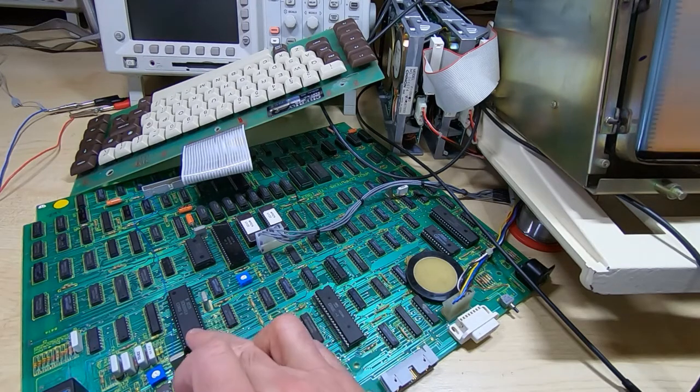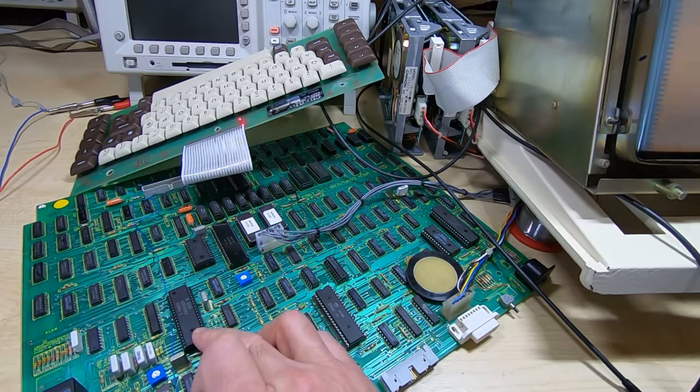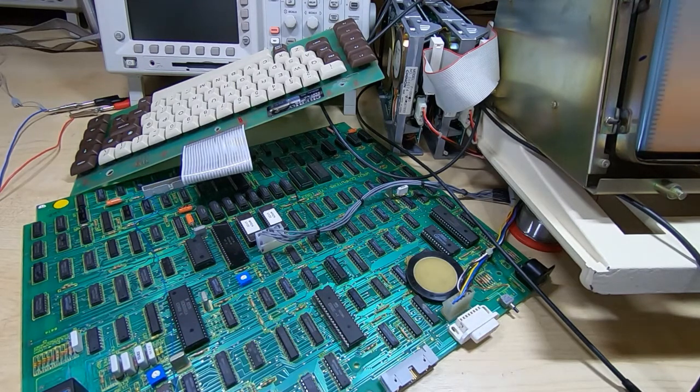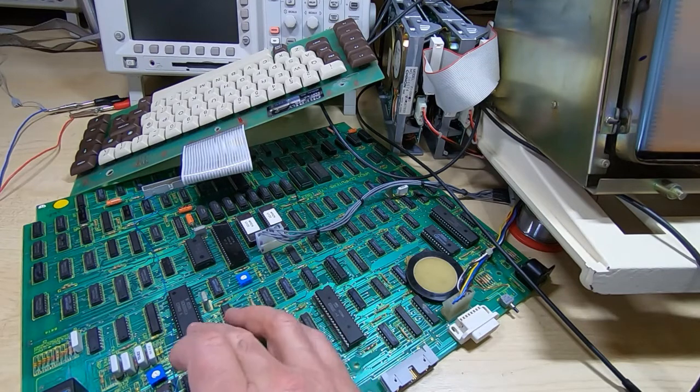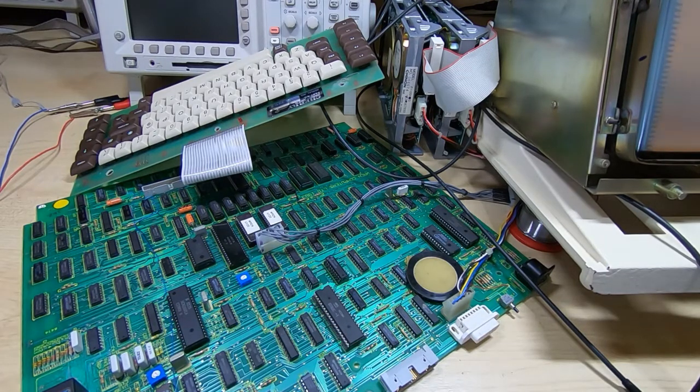But it's fairly pointless, to be honest, because if you can put it into the loopback mode, it means you can read and write to the control register within the device anyway, and you use the same data bus and address and control lines to do that you use to read and write the input and output registers. So in other words, if you can put it into the loopback mode, the loopback mode test is fairly pointless because you've already proved that the device is working to that extent. Generally speaking, loopback tests are only really useful when it's a loopback of the output from the machine looping back into the input, and that's generally done on more advanced machines using some device to switch the output to the input and to disconnect the output from the socket just in case something's plugged in.